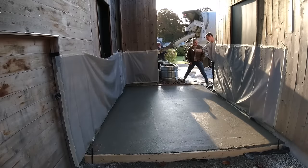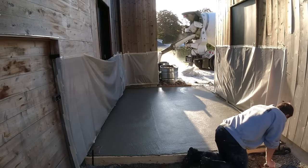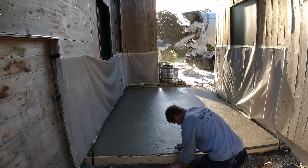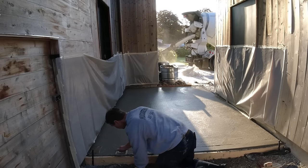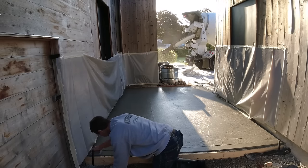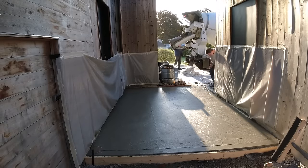When we finish concrete with air entrainment, we typically don't like to steel trowel the surface — sometimes that seals the surface off and causes moisture or air that's trying to escape to get trapped right underneath, creating blisters and bubbles. So we typically just mag float the surface to help keep it a little more open. Now I'm cutting the edges in with an edger, rounding the edges off — we do that on all our exterior concrete finishes. As it sets up, I'll grab my stainless steel skids and start mag floating it out, getting it ready for a broom finish.